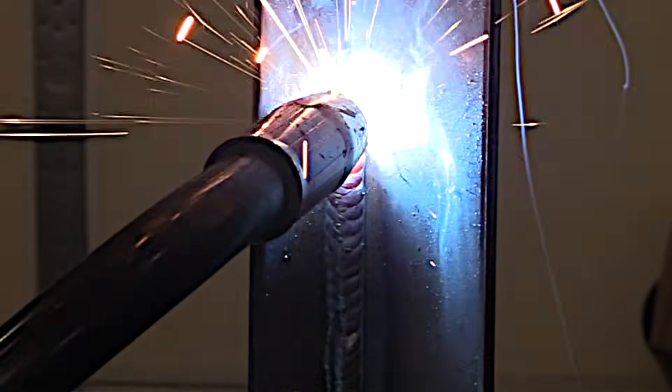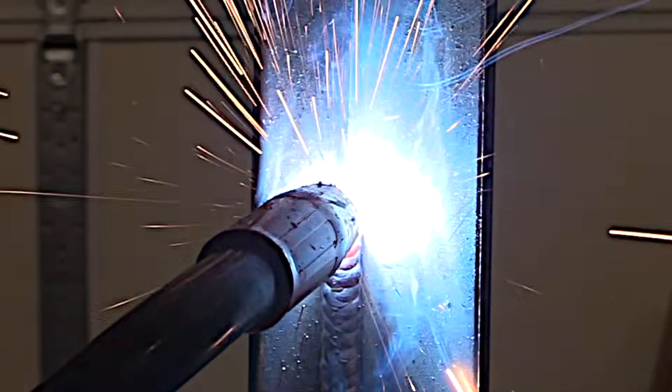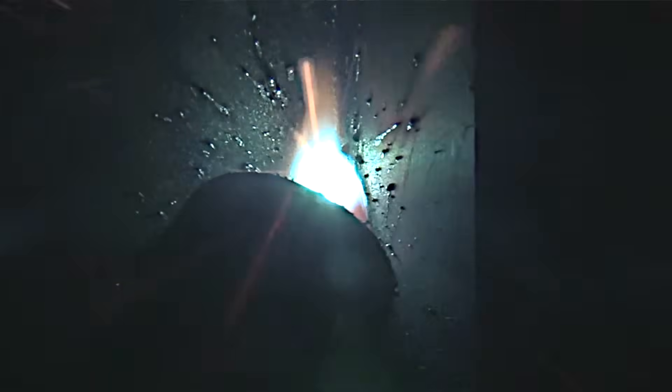Having a good ground by clamping the ground directly to the metal you're welding really helps. I didn't do that here — I forgot. I had the ground laying on the table and I sputtered a time or two. That machine doesn't care; wire is going to come out whether you intermittently lose your ground or not. It's going to sputter and you're going to think you don't have your settings right. Get a good ground.